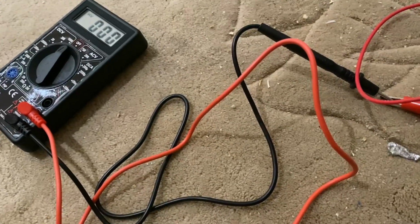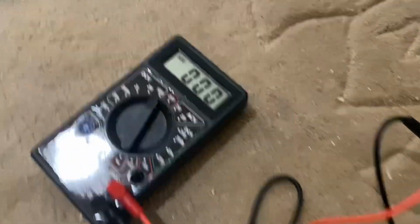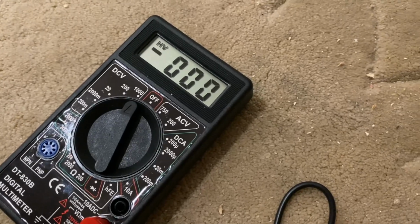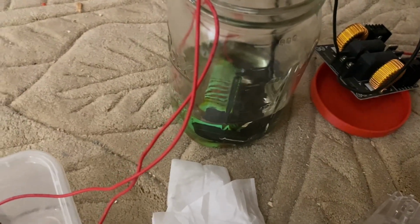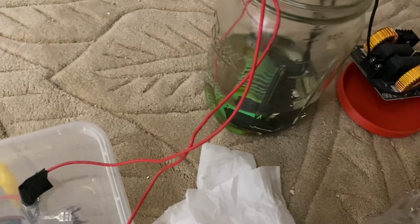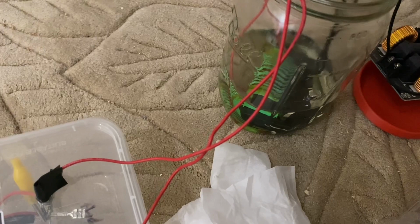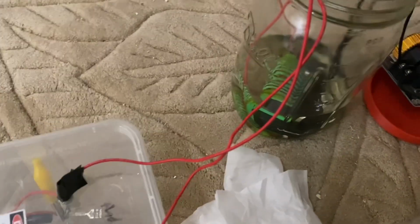And of course that's just connected to the DMM, and that's on the 1000 volt rating. And all you have to do is multiply it by a factor of 10 to get the actual reading. And so then push out 2 kV. So now I know how many stages I need for my voltage multiplier to power like an X-ray tube, which requires way more. It's like 80 kV or something like that. So I'm gonna probably do that circuit next.